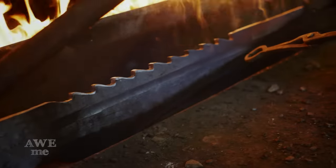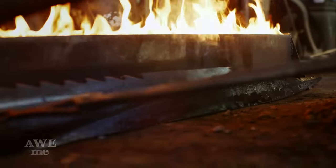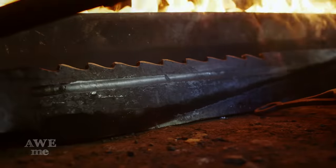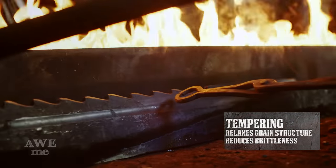That's about the edge quench from hell right there. This part was not quenched. At this point the heat that this thick area has retained will start creeping back on our edge and kind of self-temper. We're still gonna play it safe and temper it again. But that's the whole idea about doing a big thick blade like this.